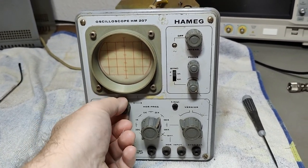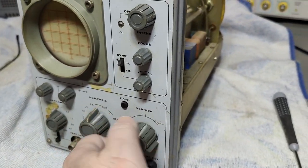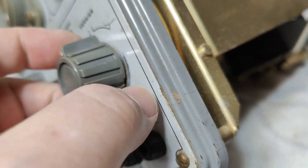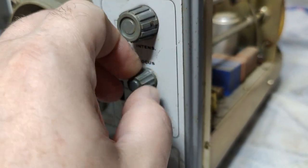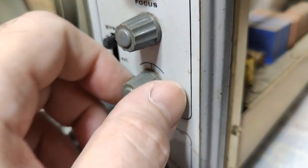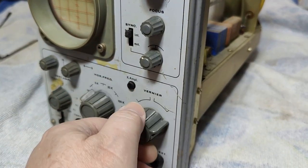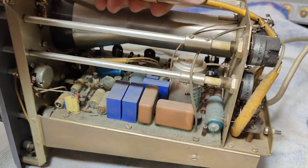It's working super smooth now. I went through all the contacts and moved all the knobs a little bit. Is it difficult to avoid stuff like this? You gotta be an absolute muppet to put all the knobs so they touch the front plate. All of them more or less touch — they're supposed to be just half a millimeter or a millimeter clearance so you can stick in your nails, but they're not supposed to touch and grind. So yes, I have to fix all that as well. This is definitely not the first time I see this — people really think the knobs need to touch.